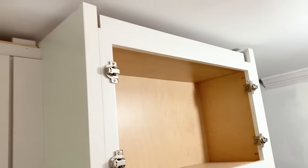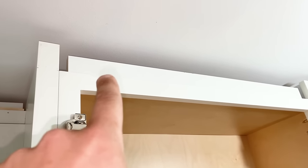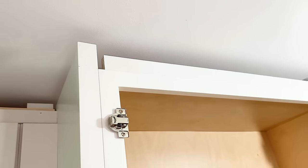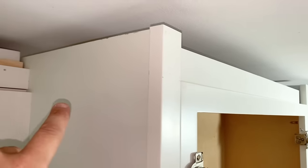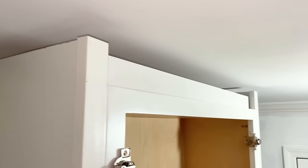So I've taken the doors off. And what I'm going to do is rip a piece of quarter inch and go around just like that — put a piece in normal, bump this out. But I'm not going to just butt the quarter inch piece to this. I am actually going to cut this flush with the top of the cabinet — right at the top of this cabinet I want to cut this. I think it's just going to look more uniform. I could just butt it here and butt it here, but I think it's going to look way better if I just cut this off and do a 45 and wrap it right around. So I'm going to do that same thing on both sides.